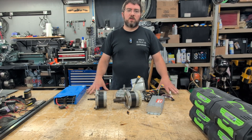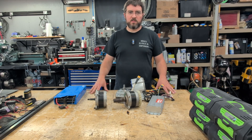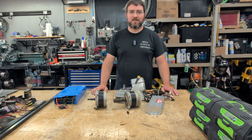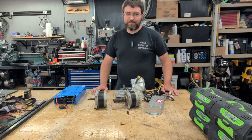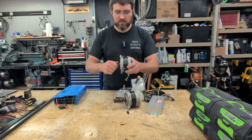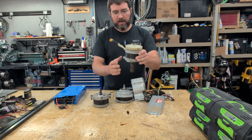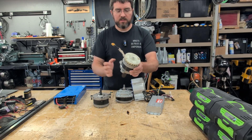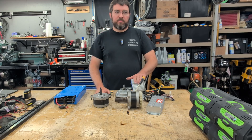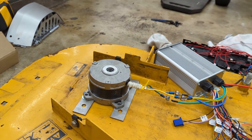I fully stripped down the chassis and started ordering parts. For the deck motors, I figured a little plastic Ryobi push mower can cut grass, so the motor would be a good starting point. I would eventually end up overpowering it just so we could cut a little grass, but this mower ended up being a little bit faster than a push mower. The shaft on these Ryobi motors isn't long enough for where the blade needed to sit in the deck, or nearly beefy enough. So I ended up machining a one-inch diameter extension that the blade bolts onto, going down into the deck. I also took the fan that used to be on the bottom of the Ryobis inside the plastic and mounted it on top. The main consideration for mower RPM is the tip speed, which should be a maximum of 215 miles an hour to prevent excessive projectiles coming out of your mower. The first time I spun up the mower, I took a video — this is legit scary.